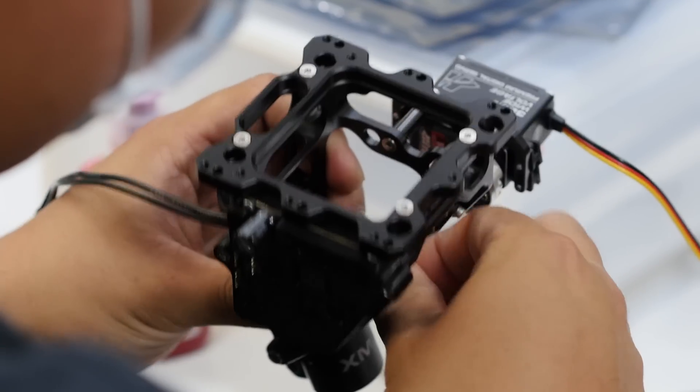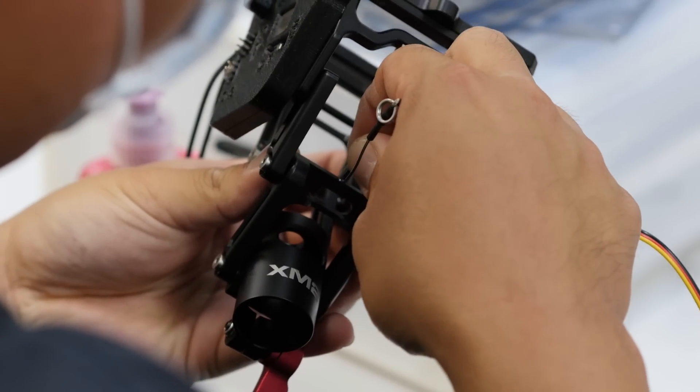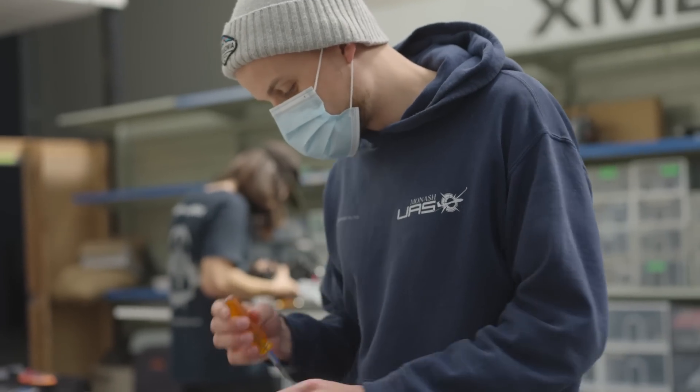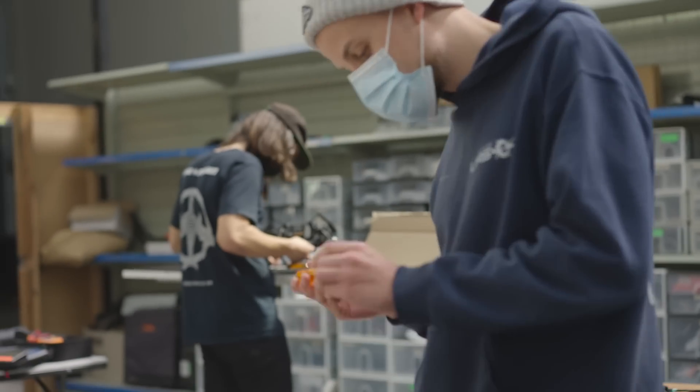From my perspective for building them, it also saves on internal components in the drone — it takes out a whole other BEC, which is extra weight we've now saved. The power input range is a lot wider too, so we're not as worried about having to run it off specific power rails that are shared with other components in the drone.